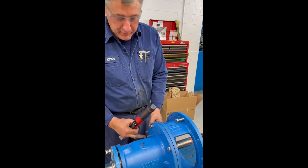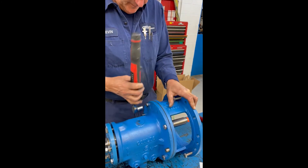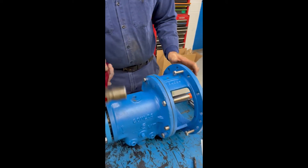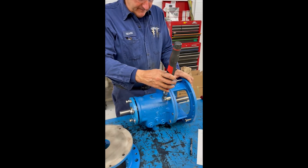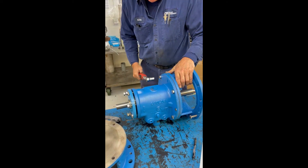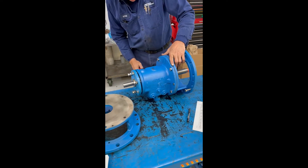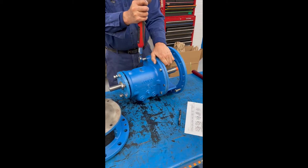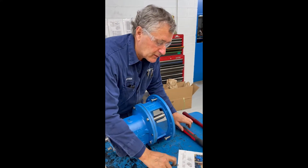I had previously dropped it on and aligned it partially onto the pins, and got the bolts started — ran the bolts up just to snug, just to bump — so we can then come back and set the pins, which will ensure a proper lineup. Come back and verify our torques. Then I'll roll one more time, and that spec will be noted on the build sheet.